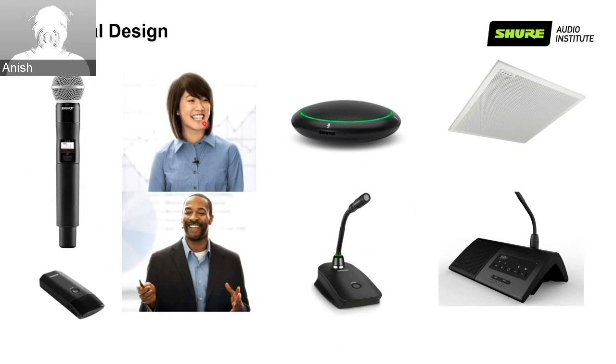Next is a body pack. Body packs are designed to be very small and unobtrusive, keeping the user's hands free. The advantage of a body-worn microphone is that it maintains a constant distance between the presenter's mouth and the microphone, so your gain level is more or less constant. Moving on to the boundary microphone — they are quite common in conference rooms due to their low profile design, and have other functions like mute switch and LED indicators, and can cover one or a couple of people at the same time.